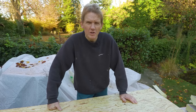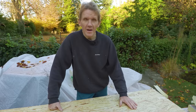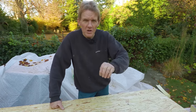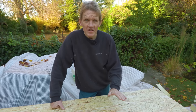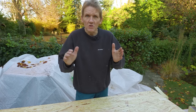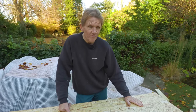Of course you've got to stop it getting wet when you've laid it. You need to leave an expansion gap — I usually use a nail just to make an expansion gap all the way down — so when you fix it down, leave that little bit of expansion gap so that it can move as the moisture levels change. It's got a fairly water-resistant face to it.